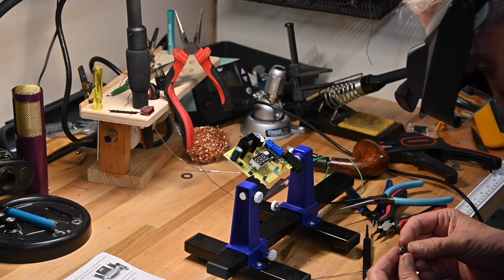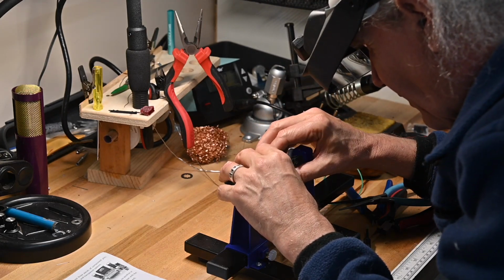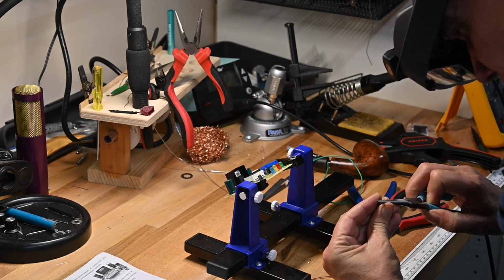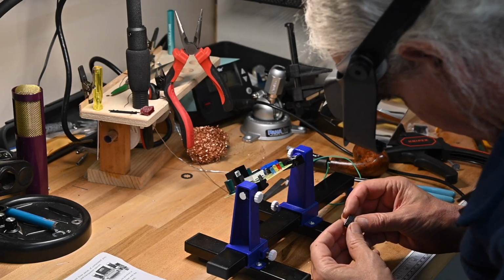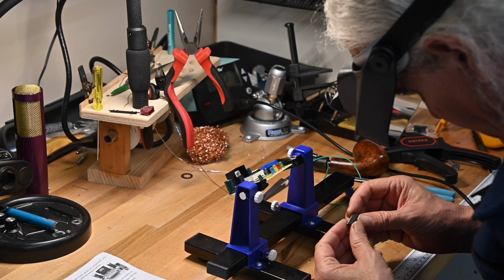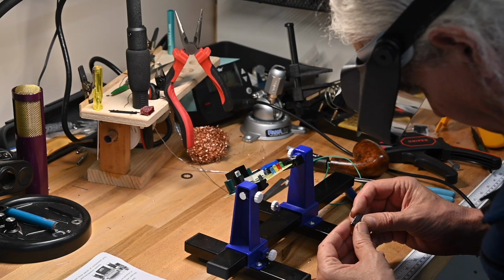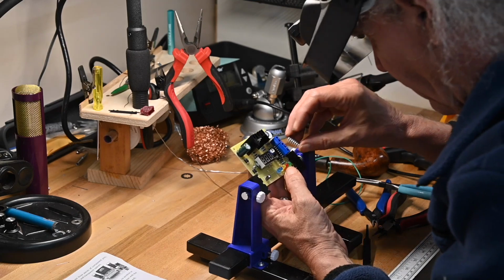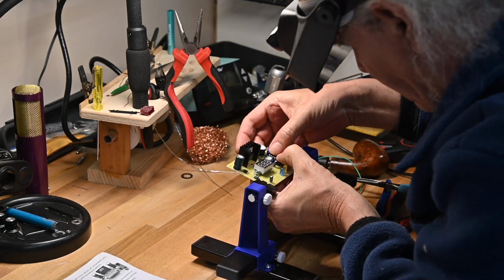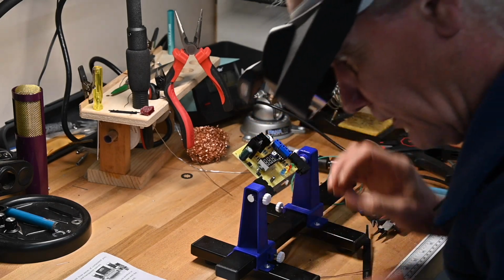Where's the notch? This is a little Texas Instruments part. Wait, my legs are bent in too much on this side. I'll read off the number. It is a Texas Instruments HYC-2032Z, or also a CD-4069BE. Okay, notch to the right position. Legs all looking good. And all seated with nothing bent. Yep. All good. Now we can put the potentiometer in there.